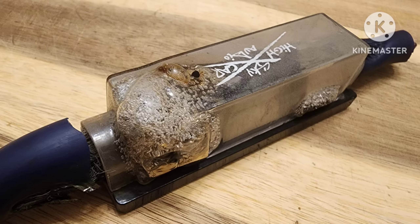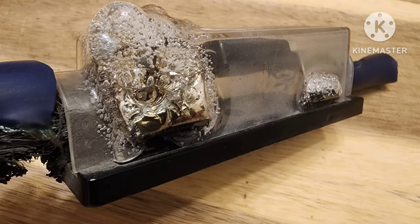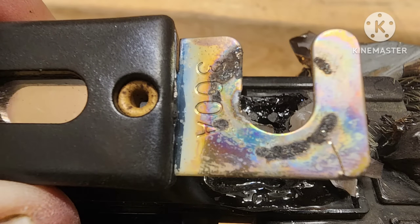As you can see, the plastic is all melted around the bolt on one side more than the other. The metal is actually deformed and the plating on the metal has come off — that plating is part of the issue. On the end of this fuse where it slipped out of the bolt, you can see all of these little points where arcing has happened — that's where the power has jumped from one conductor to another that weren't connected.